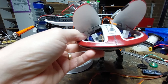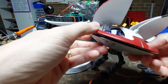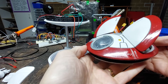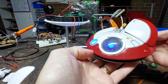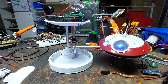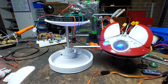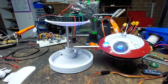I redesigned the mounts for where these went. The hinges are totally different. Used simple wire paper clips — everybody has paper clips lying around. It just plays on random times for the sequences, does a little wing wave to start with, the lights turn on and fade on, and then random timings and sequences. I ran this at the Comic-Con in Melbourne a couple of weeks ago, and on an 800 milliamp hour LiPo battery it ran for about five or six hours.